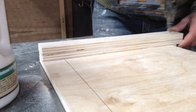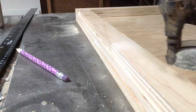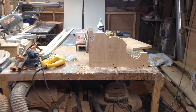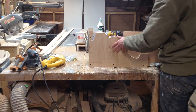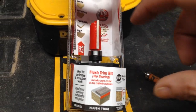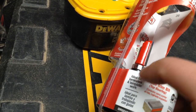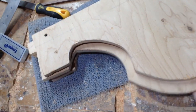I'm just building up a one-inch ledge. When I cut this pattern out, it was two layers thick so I get the identical pattern on the top and the bottom - this way I can route from both sides. Then I can just slide my piece into the jig. I'm using a flush trim bit which has a bearing on the top, and that's just so that I don't have to bog down the router with removing a ton of material. I've gone through a couple of these - if you're not careful and you push it too far, you can wear out that bit pretty quick.